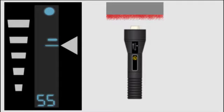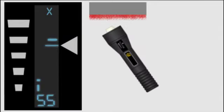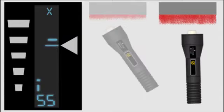An amplitude indicator measures the strength of the ultrasonic echo and helps the user orient the probe properly. A high position indicates good probe orientation relative to perpendicular. A low amplitude indicator position means either the probe is poorly oriented or thicker powder is being measured.